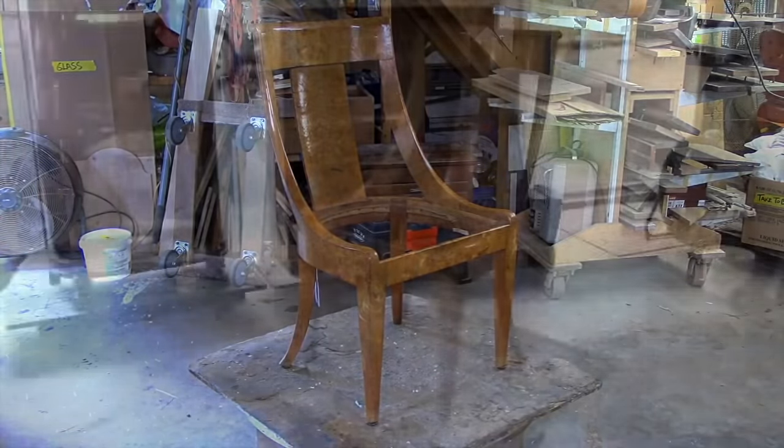From my vantage point, looking down, it looks really good. I'm trying to put on a fair amount of finish. I'm trying to put on as much finish as I can. What happens is it looks great as I'm looking down on it like this, which is fine. As it dries, it's drying a little streaky. I'm not too worried about it. I'm going to pat it again. I'm just trying to build up enough finish where then I can like steel wool it and wax it. As I get more and more coats built up, and when I think I'm near the end of the process, I'll try to put it on a little more sparingly just to help avoid any streakiness. All right, this is the second coat for the center section.